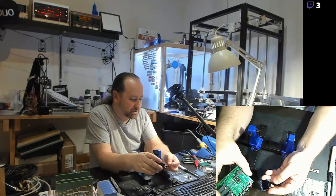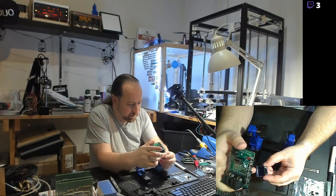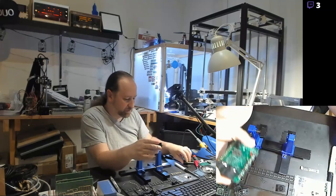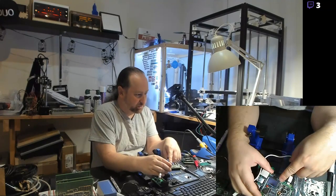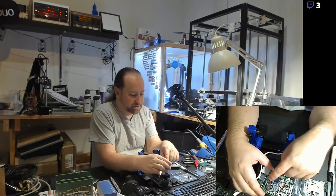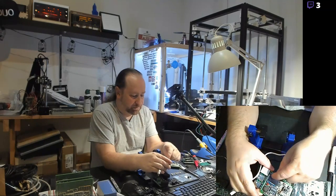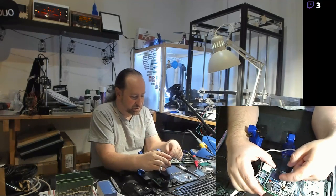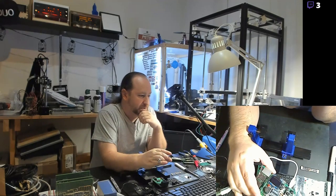We just bought three of those OLEDs. These are just the generic ones. I think this one's a blue one. I've got tons of them flying around, just the little 128x64 blue. The one I have on my prototype board is one of the super cheap ones that are blue on the bottom two-thirds and yellow on the top third. They still have the same resolution, and they still work okay, but they were intended for a media player or some application where there was status on the top and all the details were at the bottom. So when this one boots up, it's actually yellow and blue. It's kind of funny. We're using it to display GSM signal and phone number.